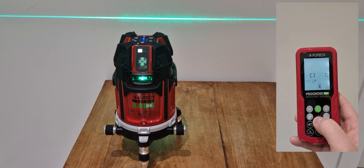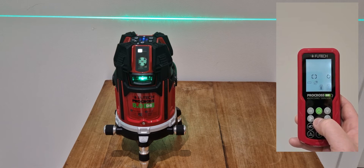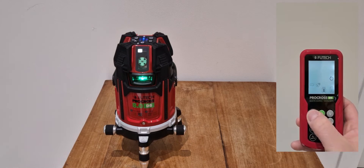For example, with a rotary laser it rotates constantly around you, and the problem with that is if you have glass surfaces around you, the detector will go crazy because the glass will catch the line and reflect it back, so you end up with more lines — it splits up. In this case you can just switch off the rotation and work only on the front.